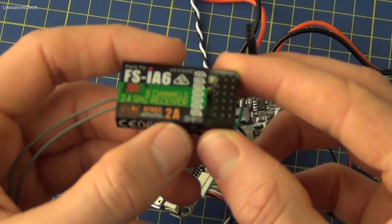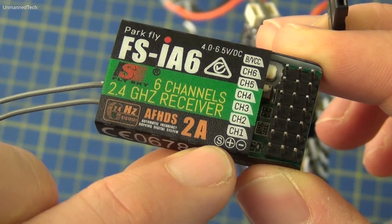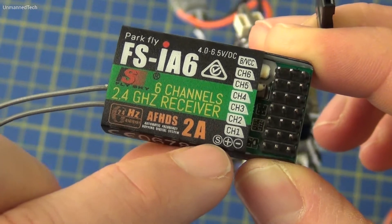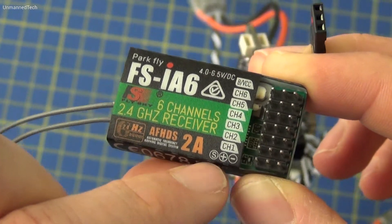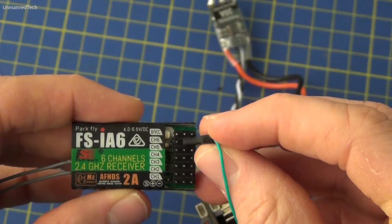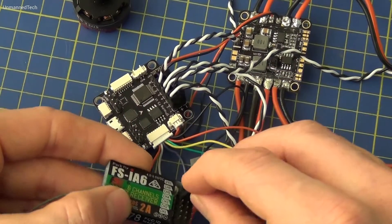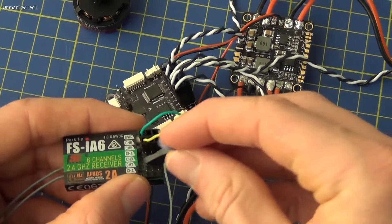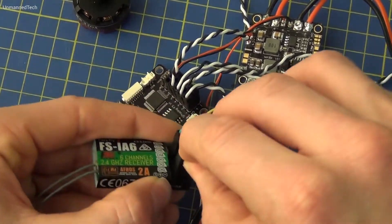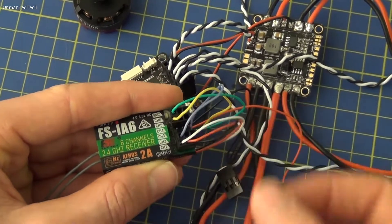Starting with the green cable on this harness, I'm going to plug this into channel six of the radio receiver as per the diagram. You'll see at the bottom there's an S, plus, and minus — the S stands for signal — and all of these cables from the power harness are signal cables. We're going to plug the servo connector so that the cable is plugged into the pin on the left side of the rail. We then move on to the yellow wire which plugs into channel five. The blue wire plugs into channel two, and then the red, white, and black cable which powers the receiver plugs into channel one. Make sure to plug it in in the correct orientation.